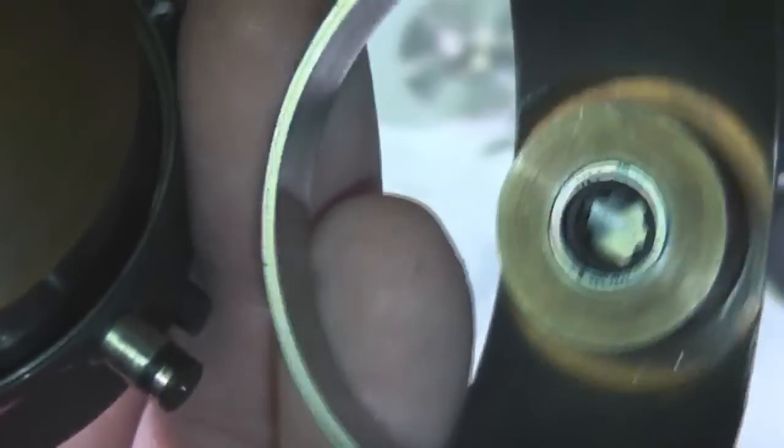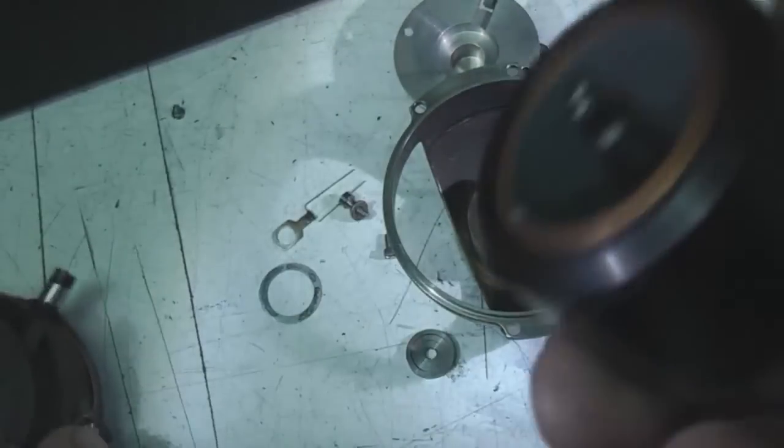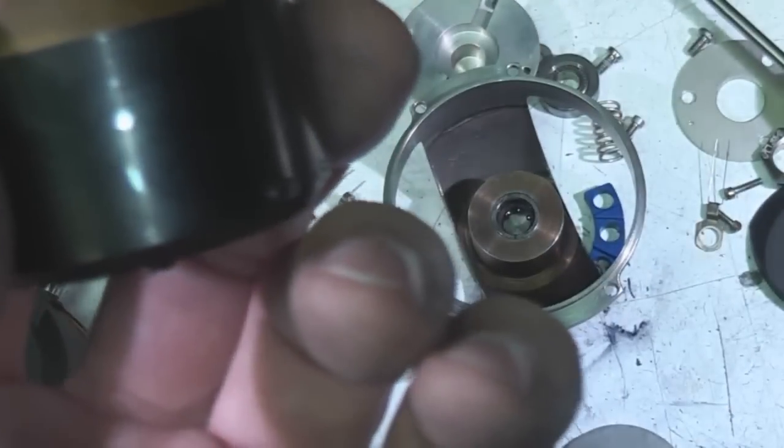You can see the balls of that end bearing in there. Again, that's just the inner core, which looks like an induction motor type core. There's 6 connections on there. Again, obviously all the weight's concentrated on the outside to give the most inertia for a given mass. Here you can see all the drillings for the balancing.